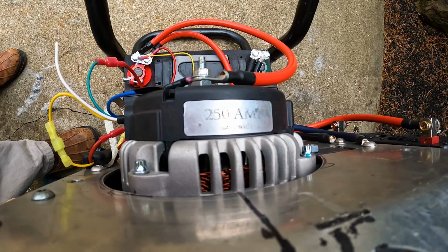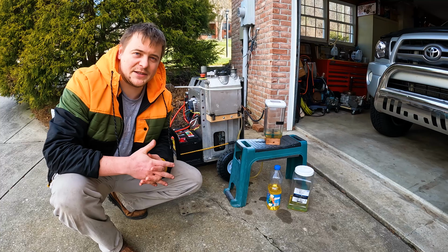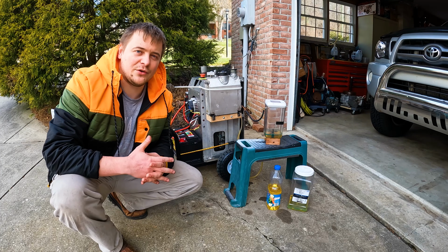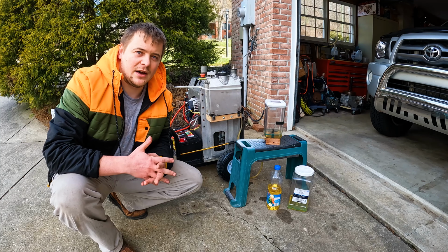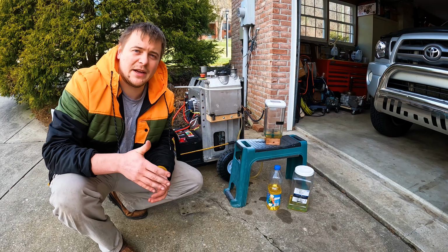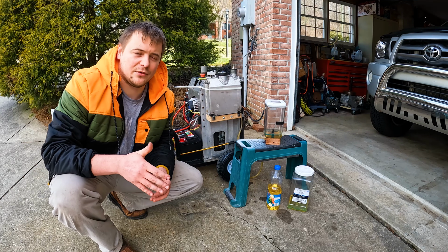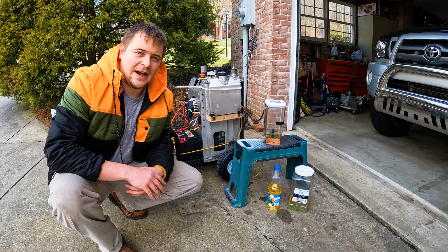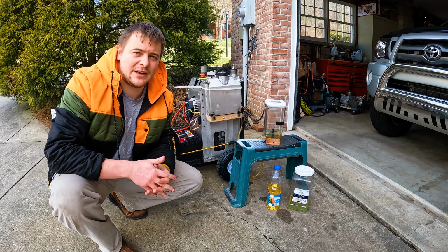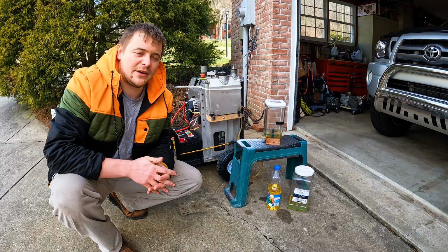Although this alternator is rated at 250 amps, I don't think it's rated at 100% duty cycle, meaning that it's not designed to output 250 amps 100% of the time. So it can give it for maybe 10 minutes, and then it has to take a break for 5 minutes and only output 100 amps or so. I don't have much detail about this alternator, so I can put a link to it in the description, and if someone knows more about them, they can comment on that.